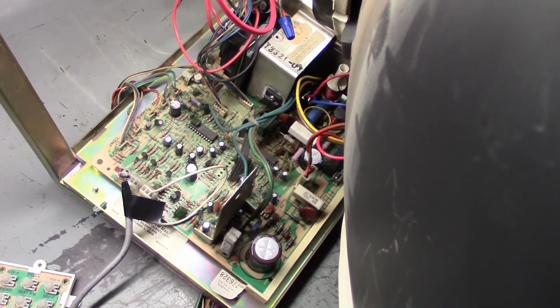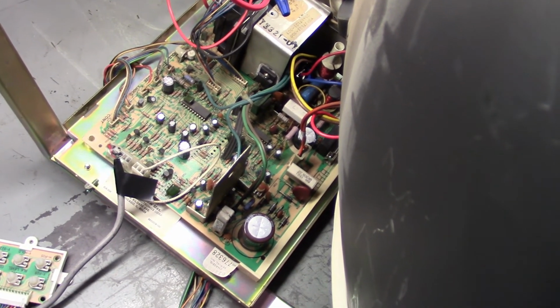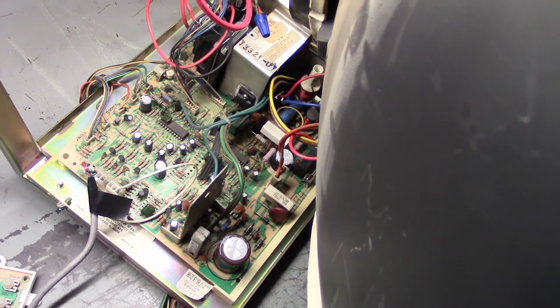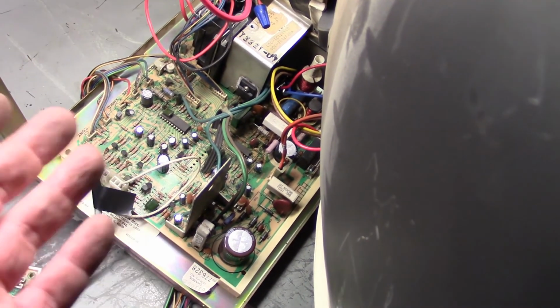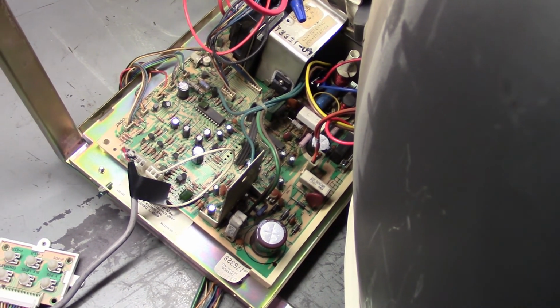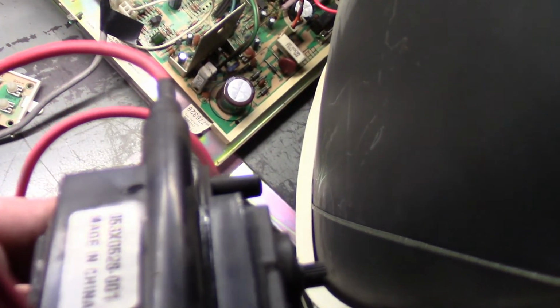I got a message saying that the monitor had died, but you could still hear the game running, the marquee was on, all that. So I went up there and checked it out, and sure enough the fuse was blown, the chassis was dead. And I brought it home to check it out, and it was very easy to spot what had happened, very common. The Flyback decided to arc a giant hole in the side of it.